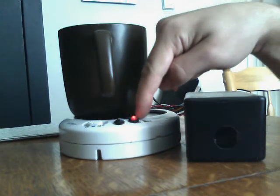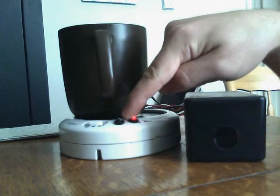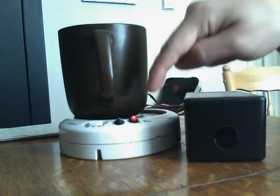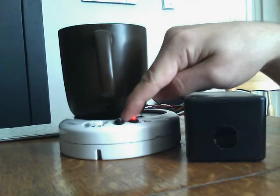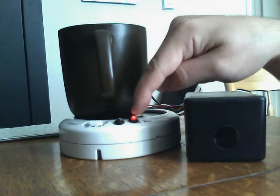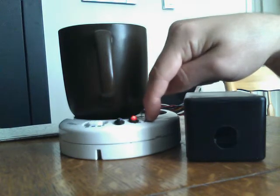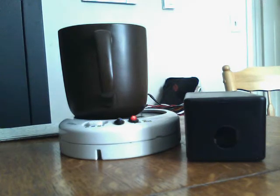Once it heats up, you'll see the relay indicator turn off and this light will come on probably as red or green. Then, since the relay's off, the plate will begin cooling. As it cools, you'll see this turn blue, indicating below 115 degrees I believe. Once that happens, the relay will kick back on, take it back up to 170, in which case it shuts off.